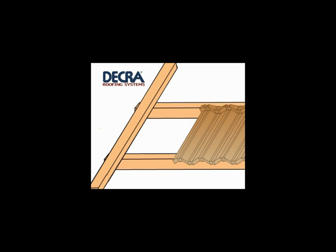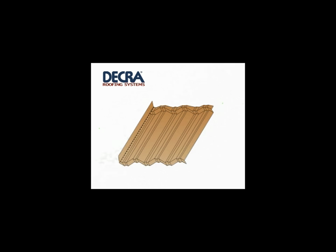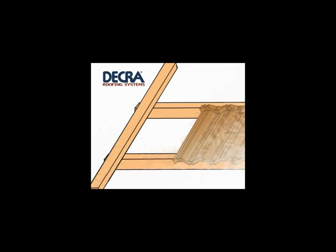Part tiles for a gable are measured in the same way as hips. The dimension from the centre of the ridge valley to the inside of the batten to which accessories are installed is recorded. This is then transferred onto a full tile. 40mm is added to the length for the turn-up, after which the tile is cut and bent.